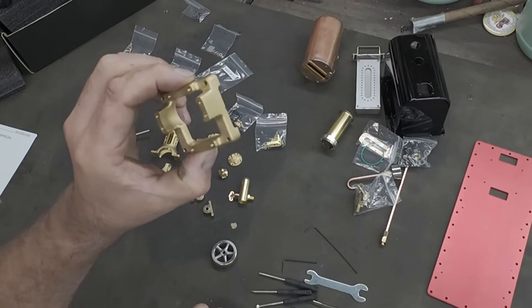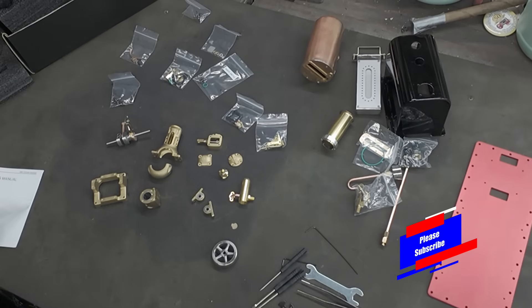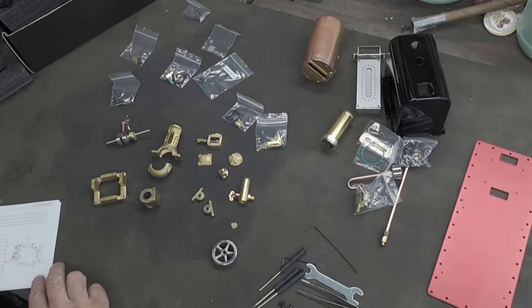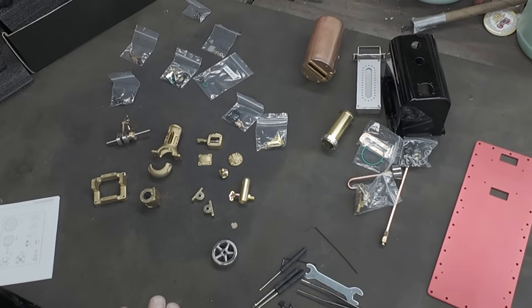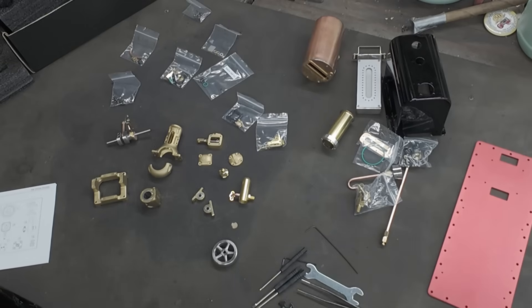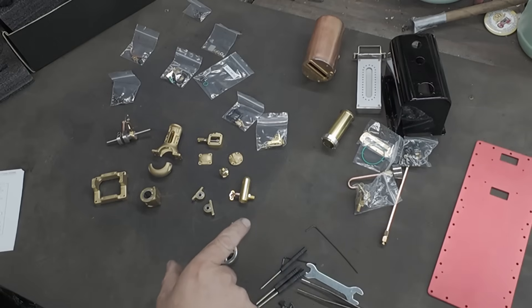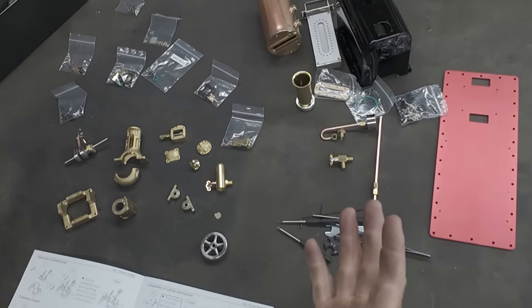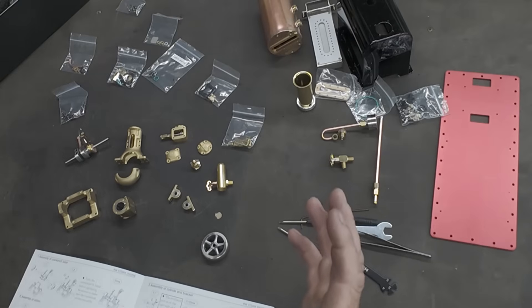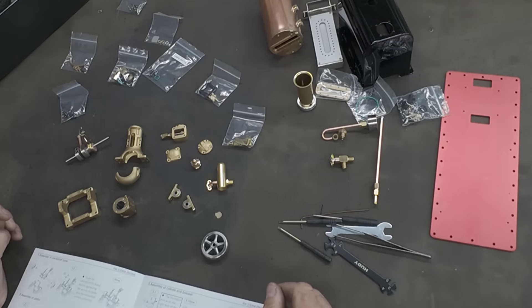It comes with a tool set, so you have everything you need right here. Except — I did look in the manual — it does say you need oils, and they're recommending Loctite. I think I'm going to put this together without the Loctite in case I need to take it back apart. As far as cylinder oil, I'm going to look into that one, because I think the cylinder oil I use for my steam engines is going to be way too heavy. I've got to look at the pressures this runs at and verify my cylinder oil will work — otherwise I'll come up with something lighter. Overall, looks like a nice kit. I'm going to assemble it, do a time lapse, and then give it a final overview.